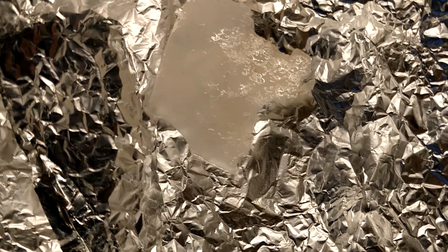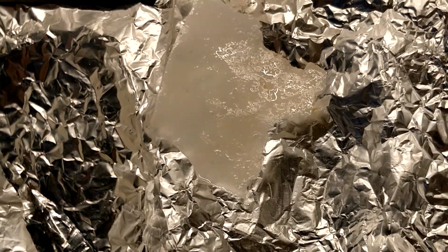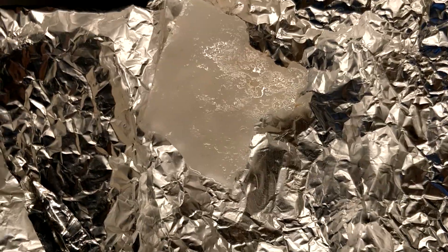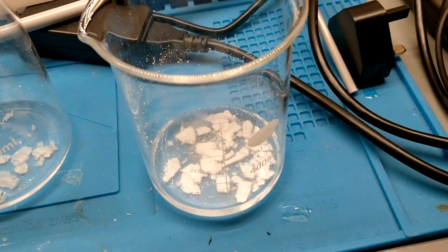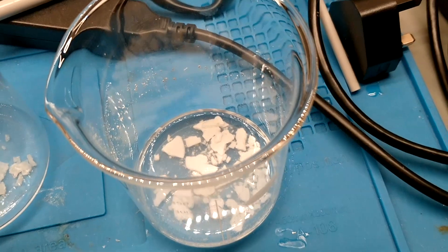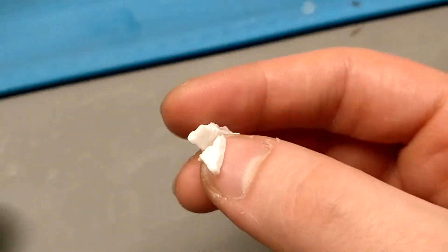What you're looking at right now is the thermoplastic starch I made in the previous Edenia installment. I was going to do some testing on this, however the properties were really sub-optimal. It wouldn't even dissolve well in water and had no tensile strength. During my initial solubility tests, I tried to dissolve some in IPA and the glycerin actually started leaching out of the starch, leaving a white powdery substance that just completely flaked to nothing.